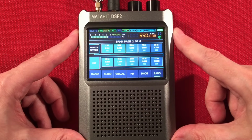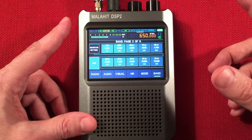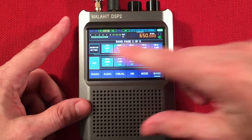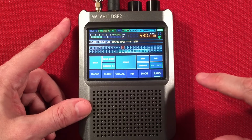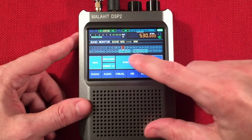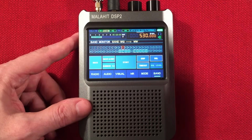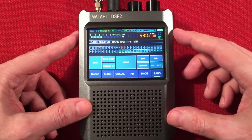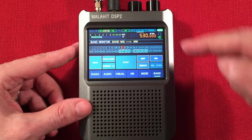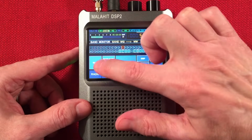We're going to go ahead and switch to the airband and VHF. So pretty much the monitor is interesting. You can do different things with it. I have set up 4 fire frequencies and 8 airband frequencies, exact to them with the squelch settings set, everything. And that's kind of how you do it. You just press and hold to change it. So go back to the band button. I think there's an exit here, back.